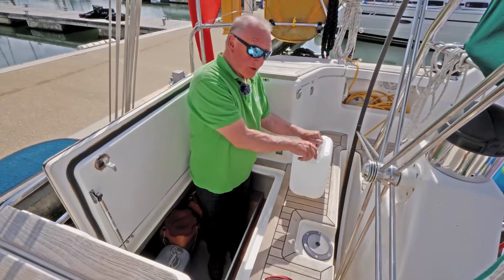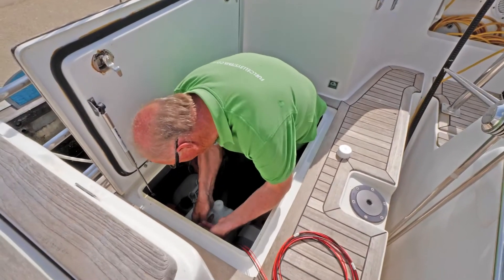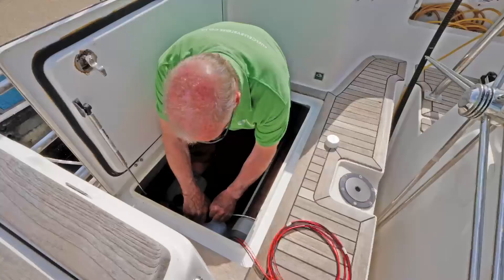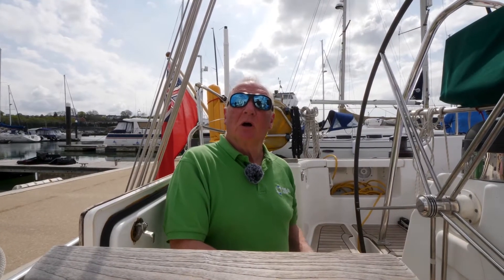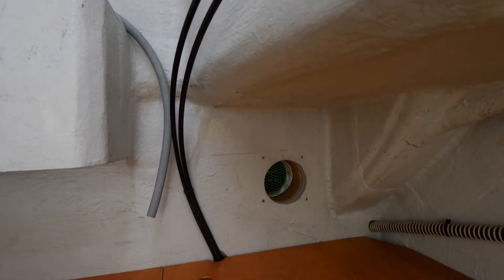We've now installed the fuel cell. Installing the fuel back — the fuel line is very simple, just take the line, screw it into the top of the M10, and that's the job done. Next is to connect up the cables to the batteries. You saw me positioning that short length of off-heat duct neatly up against the hole going into the side of the locker — the reason is to get the heat from the fuel cell away so it doesn't re-breathe that heat. It's only warm air, not hot air. In this instance we've taken the off-heat into the sail locker adjacent, and it comes out through that hole in the side of the locker.